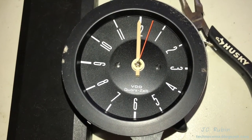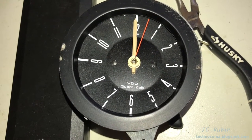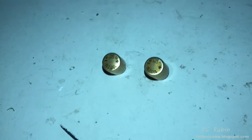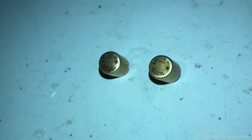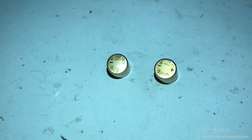This is the clock from John's VW bus — it no longer operates. We're going to find out why it's not working and repair it. John had already replaced two capacitors, but to determine if there was a catastrophic failure in the clock, I want to inspect these and take some quick measurements of these old electrolytic capacitors.